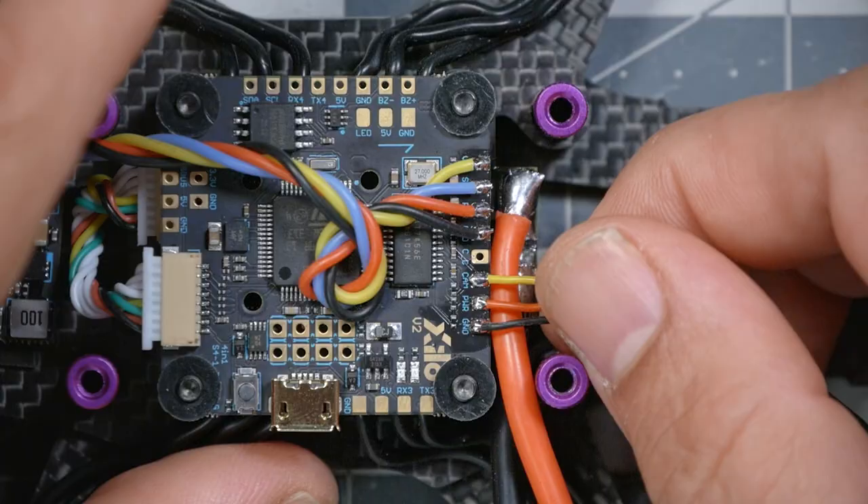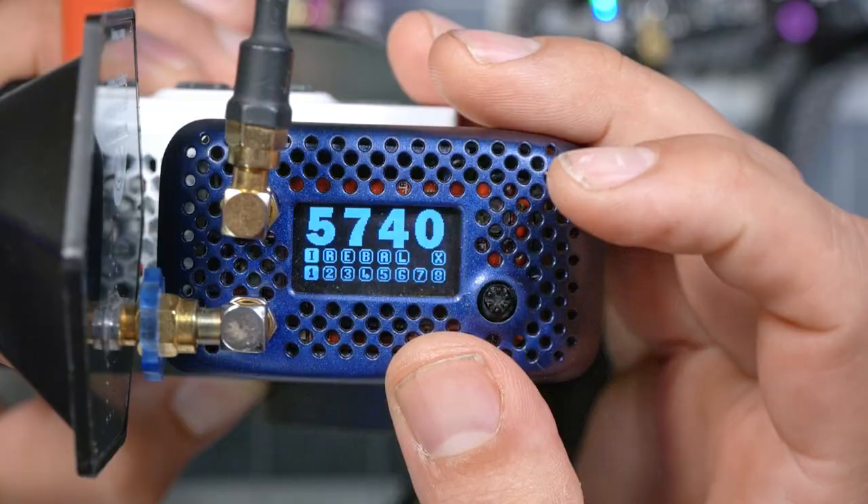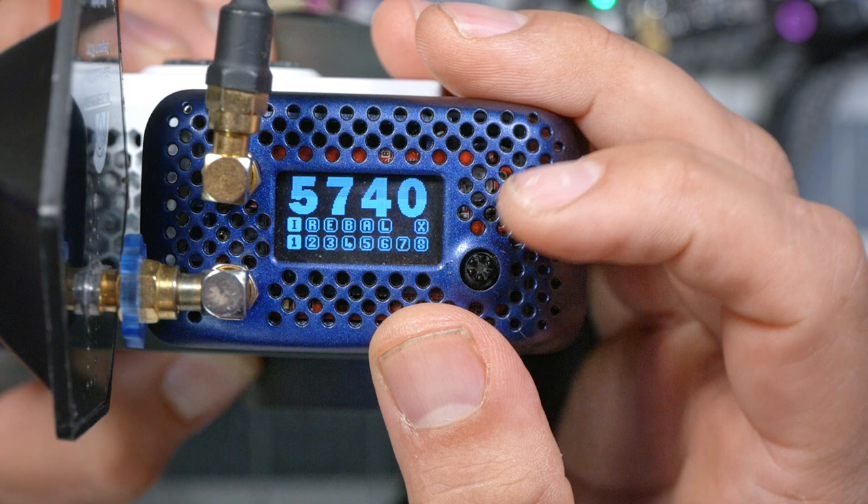Here's how the camera wires should solder to the flight controller. Notice the camera wires are soldered going forward, toward the front of the quad where the camera is, so they don't have to make a U-turn. Give it a gentle twist to take up the slack and keep things neat. At this point, if we plug in a battery and get our goggles, we should see video from the camera. Setting the goggles to Race Band 2 — yes, we have video. It's working.